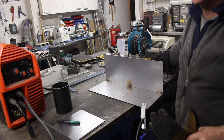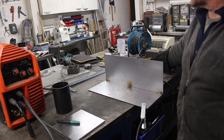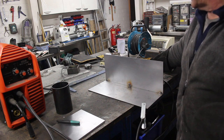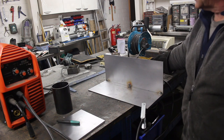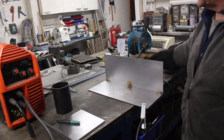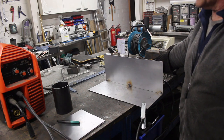I just buy these to size and square because it makes everything so much easier. I get a lot of stuff from Metals for You — I just order it, it comes square and to size, and all I have to do is butt it up and put a tack weld in. Because I'm going to get this wrong, a tack weld means I can beat it roughly into shape before I actually weld the whole thing together. So I'm just going to tack this together.